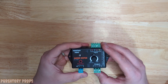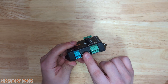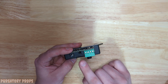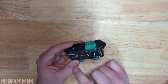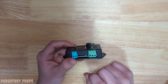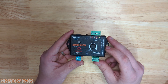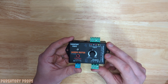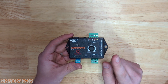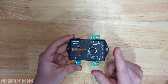The Amon motor is unique in that it features sound. It comes with an included micro SD card, which you put your MP3 files on, and it has a stereo jack for connecting to powered speakers or an external amplifier. You can't hook up unpowered speakers directly because there's no built-in amplifier. There are two folders on the SD card — one for ambient sound files and one for trigger sound files — and instructions on the card explain how to name those files. If you put ambient audio files on here, the controller will automatically play them even without an ambient animation recorded, though you can still record one to go along with the audio.